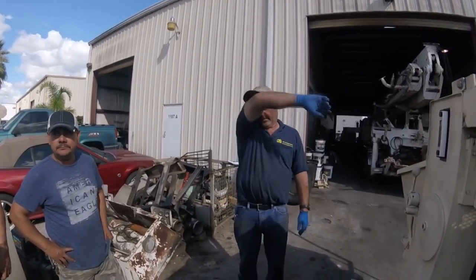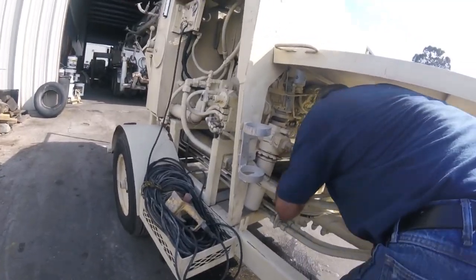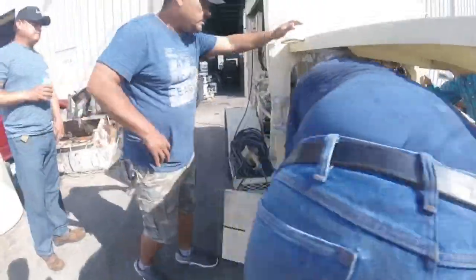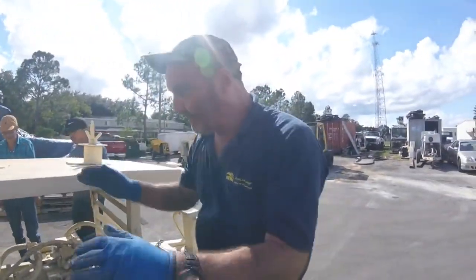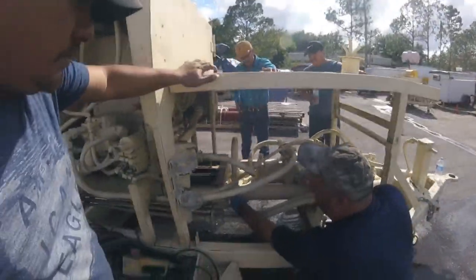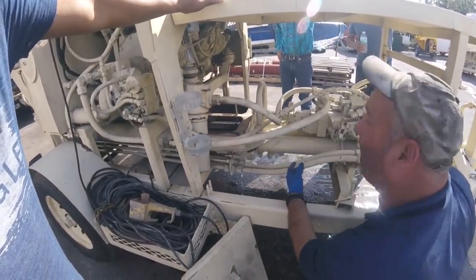It's money you're spending. Okay, so on the water box, we're leaning into the water box here. Right? So, you got a simple drain plug and a stopper. That's it. You're going to fill this up and drain it on the job. So you get to the job, fill it up. After you get done with the job, pour it out. The reason to dump it and not leave it in the water box for the next job is there's a set of glands in here that are Teflon. As that rod goes in and out, it keeps the oil behind the Teflon.